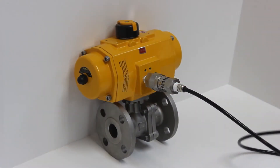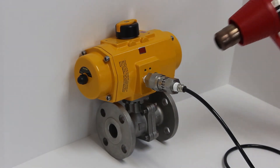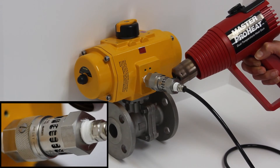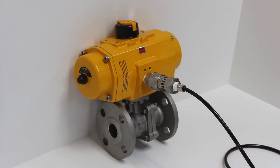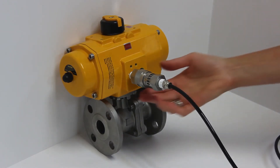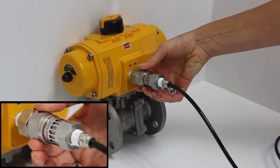The Fire Check can also be tested on a regular basis to ensure proper operation. A simple heat gun placed next to the Fire Check allows plant inspectors to trigger it, sending the pneumatic actuator to its fail-safe position. After it cools, a simple twist of the housing resets the Fire Check and allows air to flow to the pneumatic actuator again.